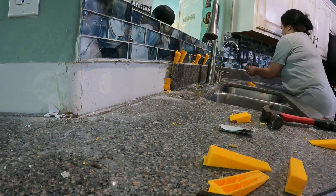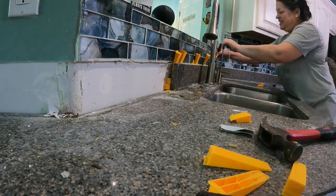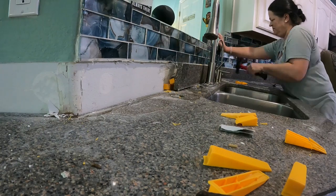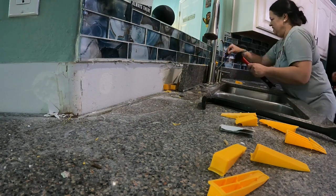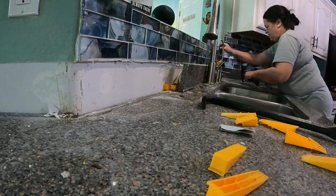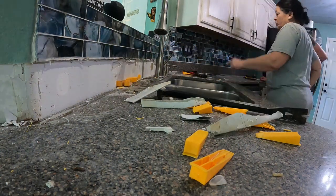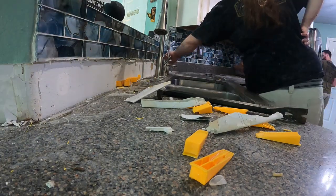Hey guys, so here we are removing the backsplash. You see I have to use a lot of these wedges and a chisel that basically starts separating the backsplash from the wall because it's just glued on. This part was particularly difficult — it gave me all kinds of billy hell. But yeah, eventually a few more bangs and we did get it out. And there she blows — just cleaning up some of that extra silicone and stuff.